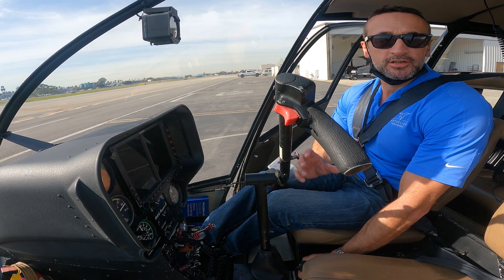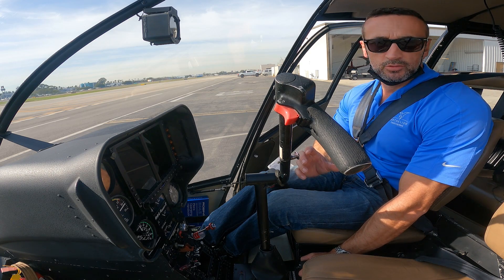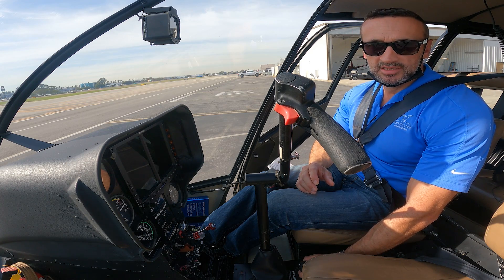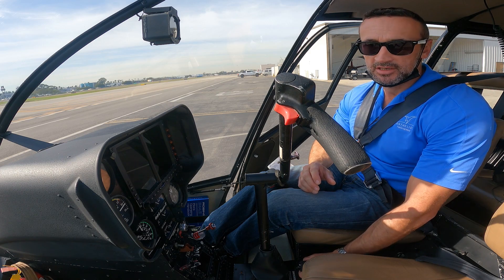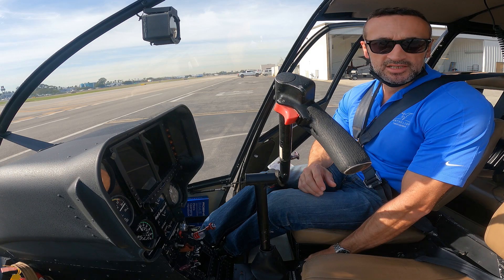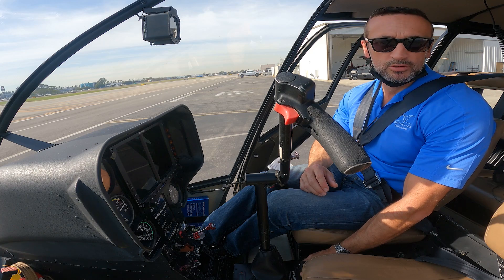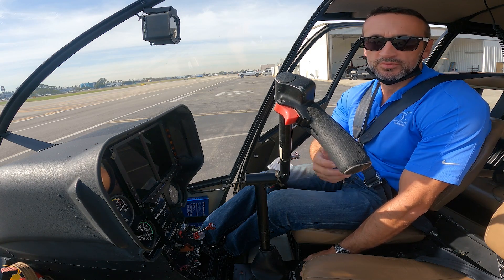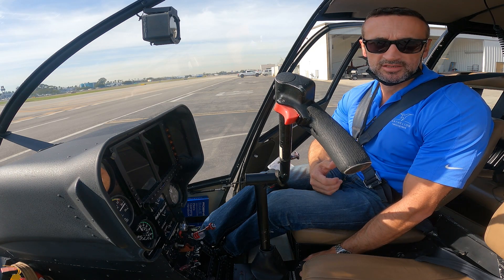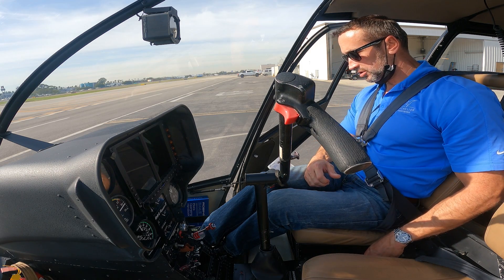Check full travel free on the throttle — unlike a motorbike, roll it away from you to make sure it's fully open, then all the way back into the detent. This is really important: one thing that will ruin a helicopter engine is a cold start with the throttle unloaded and the clutch engaged. A common student mistake is starting when they think they have a closed throttle but don't. You'll always know you have a closed throttle when it's in the detent. On starter, make sure the throttle is in that detent.